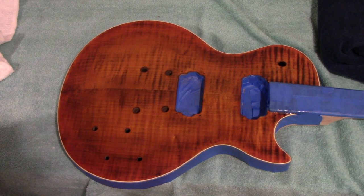I did four layers of True Oil — very thin layers. For some reason in my climate, my basement is a little bit humid, so it takes a few days for the True Oil to really cure and harden to the proper consistency. After four layers I let this cure almost a week, then ran 00 steel wool over it to clean it up. Now I'm going to start using more True Oil. This is what it looks like after four layers and a light buff with 00 steel wool, then cleaned up with a tack rag.